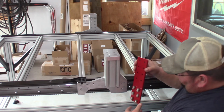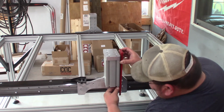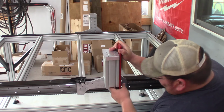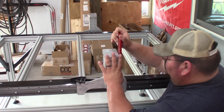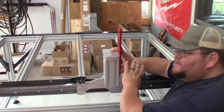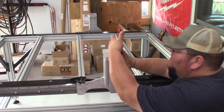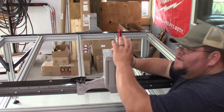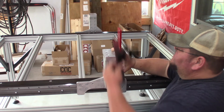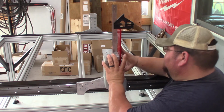So all you're going to do is get this, you're going to come in here and get them oriented. And just slide this up. And you don't have to be very precise. They're just to kind of tighten these up. When you lay the horizontal gantry going across here, you'll probably have to adjust these to get these holes to line up right in the groove of the extrusion. But 6 5/16 is probably going to be right about where it needs to be. So that looks about right.